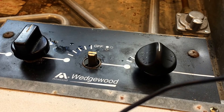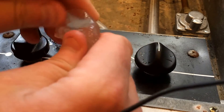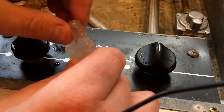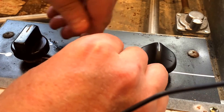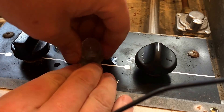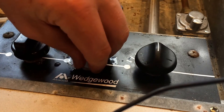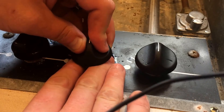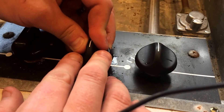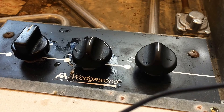Here's a technique I found that works for shaping the knobs. I'm taking some of the Instamorph out and kind of forming it with my fingers, getting it all together so it's like a play-doh kind of shape. Push it down on the shaft here and kind of form a cylinder, then hammer down the top a little. You want to make sure it's centered on that knob and there's plastic all around it. I'm going to take one of the knobs, put it underneath my fingers, and kind of push down on this thing so it takes on the shape. I push down until I feel it hit the metal of the shaft underneath, and just going to let it sit like that.